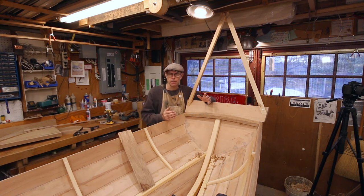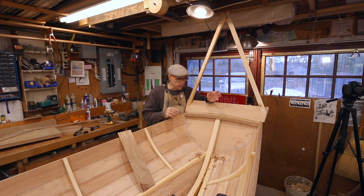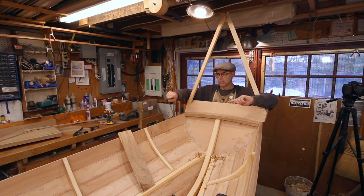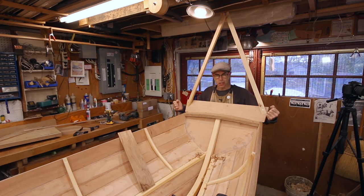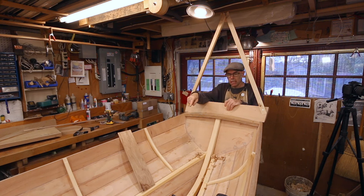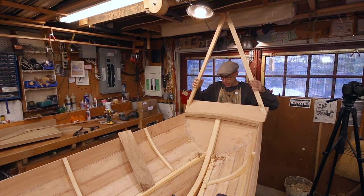I'm not even going to really try and do it as I normally would. In a traditionally built boat where there's a lot more flexibility, horning in basically means you take the corners of your transom, triangulate to your stem, and make sure they're squared up so both are equal — that affects the shape of the boat along its length. I've been playing around with this and I cannot make it budge at all. So the best I can do is make sure the stem and transom are both dead plumb. We've plumbed up across the midships, put blocking in, braced at the transom and at the stem, and put bracing below to block the bottom of the boat so it's not shifting on the strong back.